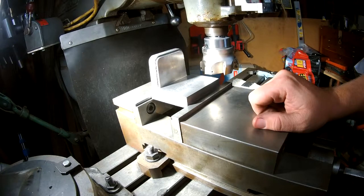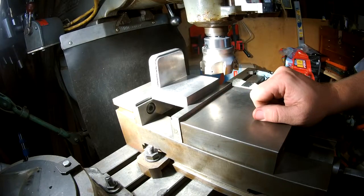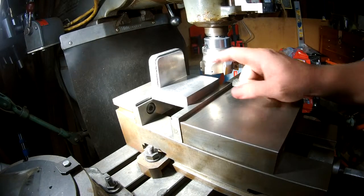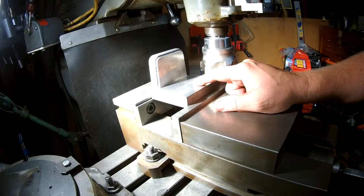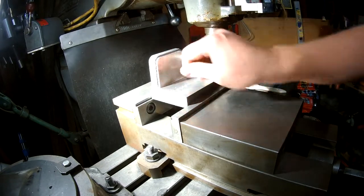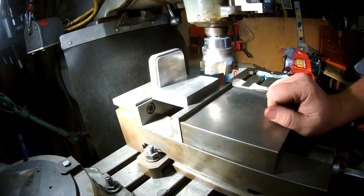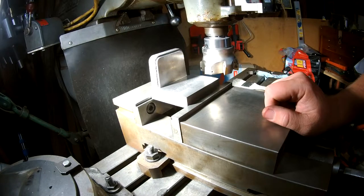One of the cutters I'm waiting for has been in the mail for a week or two - it's actually specific for cast iron. But this is actually doing a pretty good job. I can't catch a fingernail on it. You can hear a little bit - it doesn't look beautiful but that's cast iron, it's pretty good. I'm sure if I were to lap it that would just look perfect.